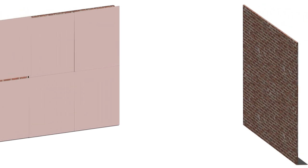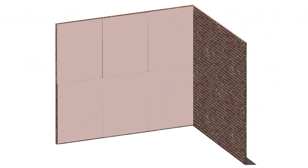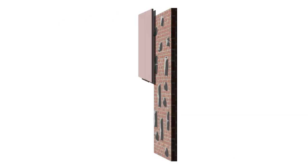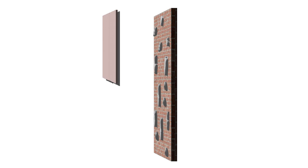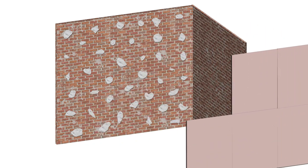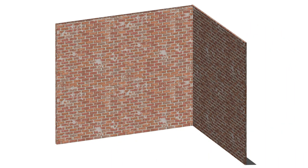While removing the wall surface is non-negotiable for a stud wall, it's a little different for brick walls. A layer of plaster straight over your brick is completely fine and can be left in place — if there are cracks in this layer, fill them properly ahead of your wall soundproofing. However, if you have a dot-and-dab plasterboard surface then this needs to go, as it creates lots of cavity space behind the boarding which amplifies the original sound. If you're unsure what you've got, tap along the wall — if the noise goes from hollow to solid it's a dot-and-dab surface; if it's solid all the way, leave it in place.